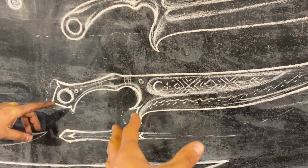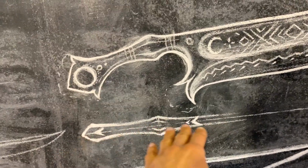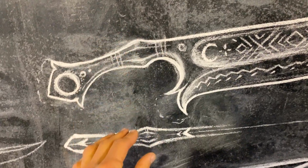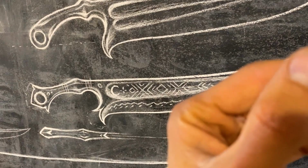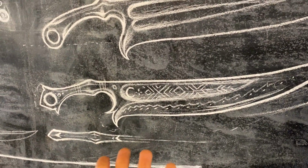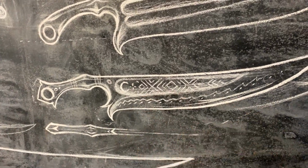I also want to highlight that the cross sections are really important. I drew this as a rough aim of what we're aiming at for the thickness, because the problem is things get too thin, and this being bronze, it is soft at the end of the day, so we've got to leave it thicker than we would a steel blade, just so that there's no risk of warpage.